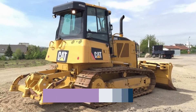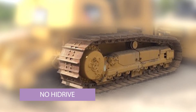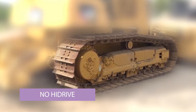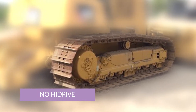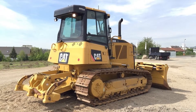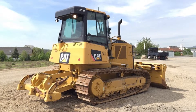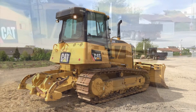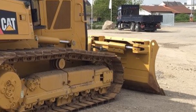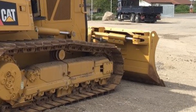This is a slightly smaller dozer. It hasn't got the high-drive — if you look back at a previous machine you'll see the tracks are triangular in shape, which Cat uses on their D6 machines and above. This is still a D6 but it's a lighter finishing machine, typically used for landscaping — for instance on golf courses — where they're just wanting to finish off. The blade is much more maneuverable than the standard large heavy dozer blade used for heavy earth moving or quarry work.